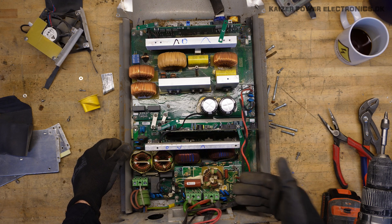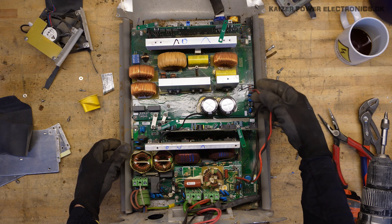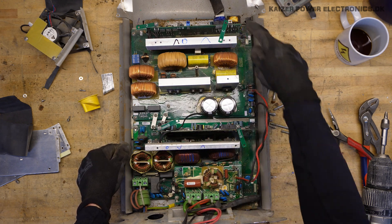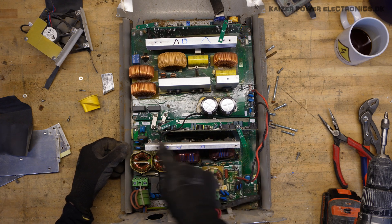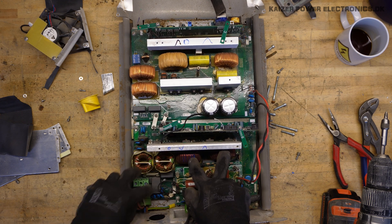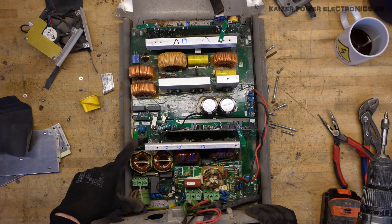The photovoltaic panel input is down here. We have a red and black wire with our DC bars going up to the upper PCB. Up here we will have the voltage regulation inverter, and perhaps even some isolation. Then we have two different control boards with a bus sitting between them, and then most likely the output inverter sitting down here on this heatsink — very thin actually. We have the output inductors and filtering here, with noise suppression common mode filtering — not so much on the photovoltaic side, but much more on the mains-connected side.